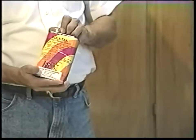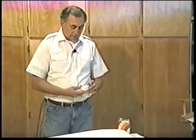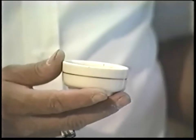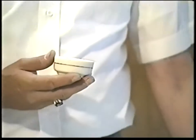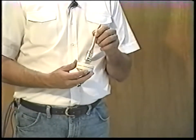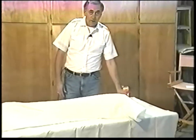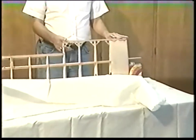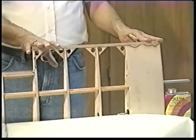The way to use the PolyTac is to put it in a small container. Put a little bit of the PolyTac into the cup and then thin it just a little bit with MEK — merely dip the brush into the MEK and stir it into the PolyTac. That's going to help it bond a little bit and thin it out because it is quite thick. It dries very, very fast, so we recommend only putting it on maybe 10 or 12 inches at a time. If you put it on any further than that, it's going to dry before you get the fabric attached.